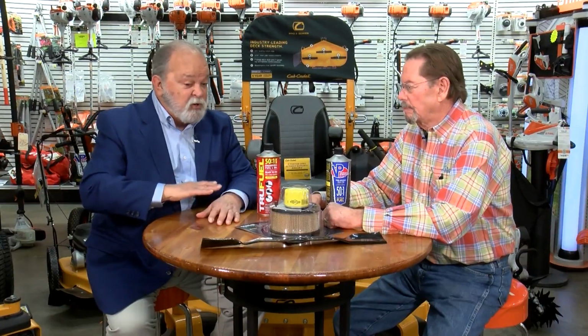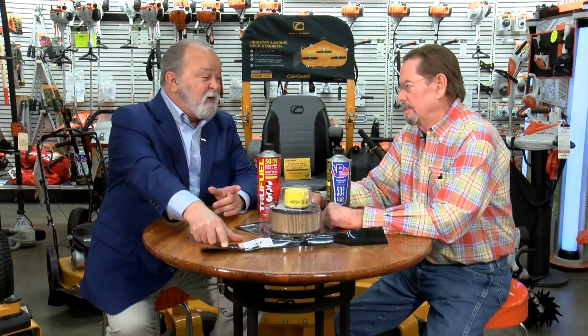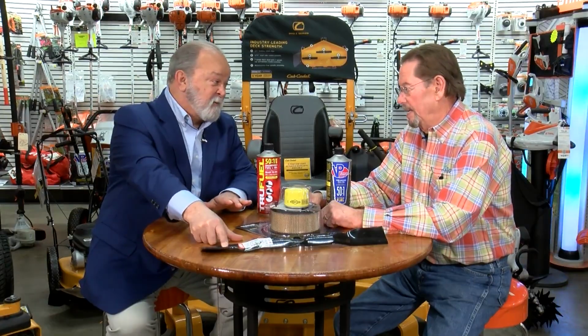Okay, so we've talked a little bit about the shop, but you also started talking about the little parts and pieces that you really need to get out ahead of. This is the time to get it done, so you make sure that everything is working through the season. First one you mentioned, of course, is the blade. If you don't have a good blade, you don't have a good cut. That's right, and we suggest you have two sets. One that's sharpened, you put on. When you take off the dull one, you're still good to go. You bring it in at your convenience. Next time you pick it up, and you're already ahead of the game. Instead of downtime, you run in here on a Saturday in a hurry and we're backed up. Be ready, be waiting.